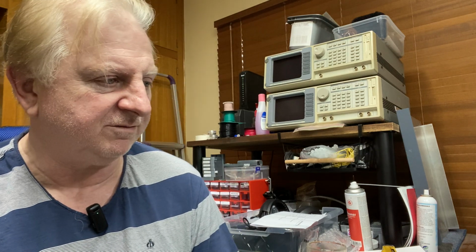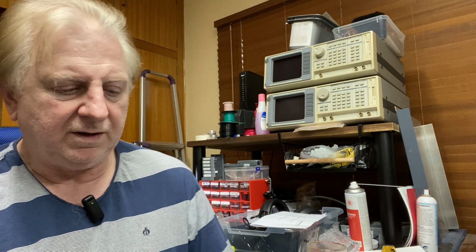G'day guys, I just did a video and I swiped the screen to get into the editing mode, and I completely wiped the video by mistake, because it was going to be a video about Hall effect sensors and how we use them to, or what I've done anyway, how to detect the magnetic field from coils. Try not to pick up the flyback, and trying to optimize the magnetic componentry, basically just the structure of the coil and how the geometry to get really good reach and sensitivity on the device.